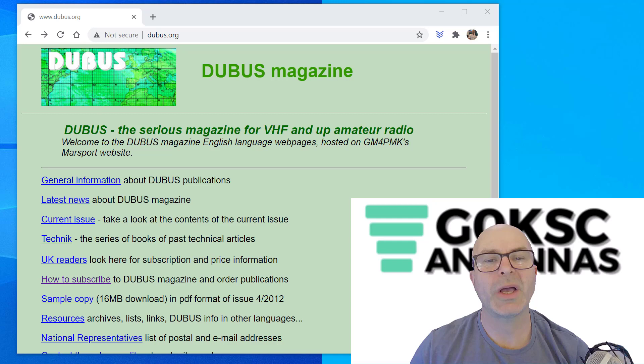In today's modern environments we're looking for very low noise antennas. We have things like the VE7BQH list, which shows a comparison between a wealth of different Yagis — albeit only at an angle of 30 degrees — comparing the effects that those antennas at that angle in a stack of four would see with regards to noise beneath the antenna, and the signal-to-noise ratio between the desired signal and any noise or signal in any other direction. When you deviate from the model you can't necessarily see that in the real world unless you have very sophisticated and expensive equipment.